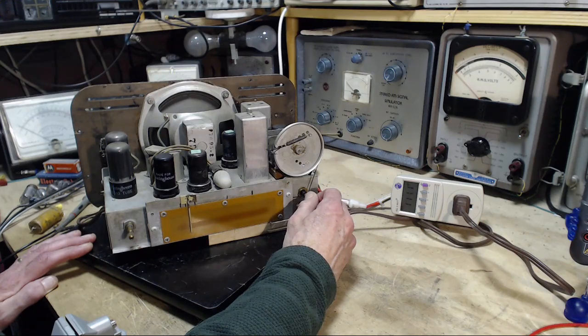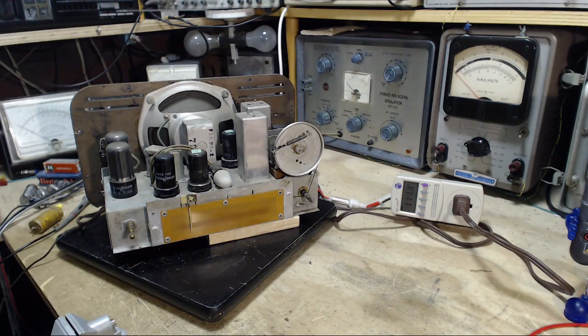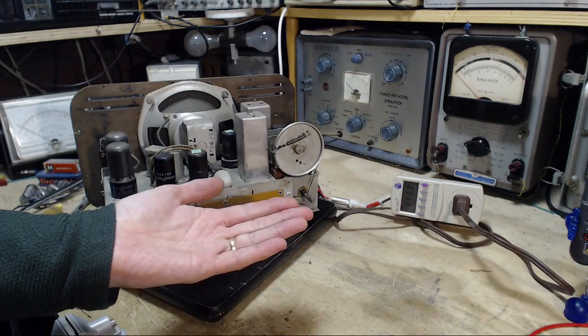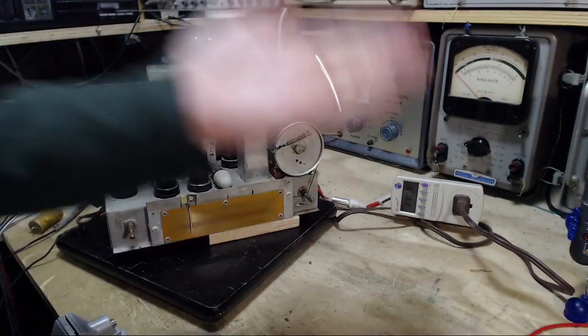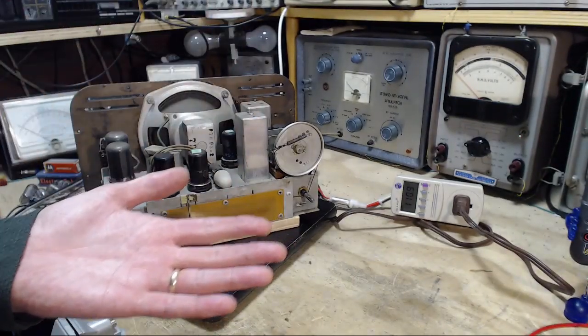Let me wave that antenna around. Oh. So the automatic light came on in the laundry room next to me, and that's where that static sound has come from. It'll go off in a minute. Like a lot of dimmers, they work by chopping the power. They don't reduce the power going to your light. They chop it. And when they chop it, it creates harmonics. There, it just went off. The light just went off.